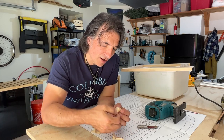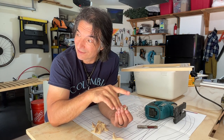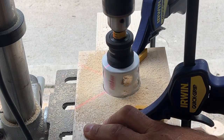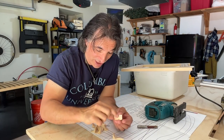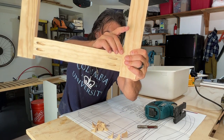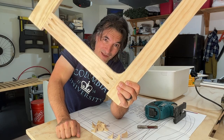The only thing we need to figure out is what to do in the corners — I don't want a sharp corner, I want a nice curve. So I came up with this idea. What you're essentially making is a right angle with a quarter circle on the inside. I used my drill press to cut a two-inch circle in some one-by-six lumber, right in the middle so I'd have grab room on either side. Then I ran it through the table saw so the blade just touched the outside of the circles. If you do that on all four sides, you end up with four corner pieces per circle. I've got about twelve of them and I'll pick the four that fit best — instead of a sharp corner, we'll have a nice curved transition the router guide can ride right along.